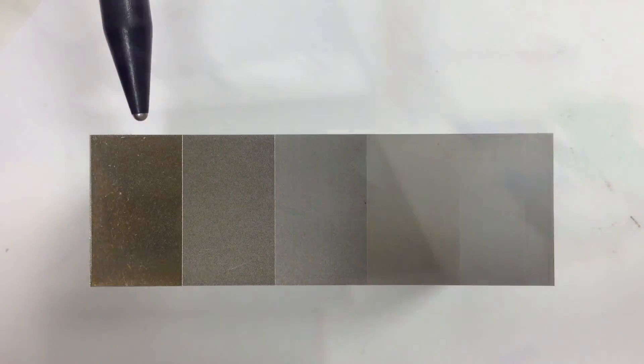Okay, we finished up our cut. Let's take a closer look at this part — we've taken it out of the machine to see what the surface finishes are. Here you see a rough cut only: it's a one pass cut and that's about a 125 finish.